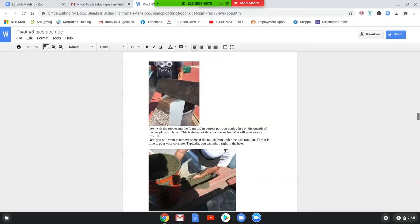Once we're certain the depth is right, we mix up one 90-pound bag of Quikrete and pour it in behind the box. It's important that it buttresses the box and goes underneath the rotational area two or three inches, giving pole vaulters that same firm feeling they're used to. The concrete goes to the line I was explaining in the top frame — we pour concrete to that line so our depth is correct. Once the concrete is in, we make some small adjustments.